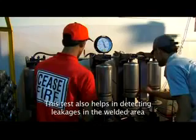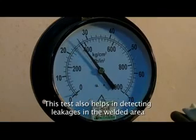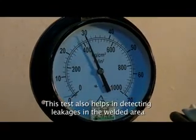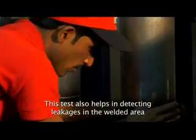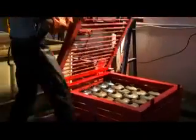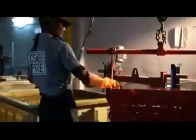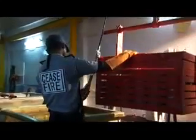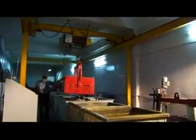Post welding, all containers are subjected to a hydrostatic pressure test at a minimum pressure of 30 kgf per cm² for at least two minutes. This test checks the pressure-withstanding capacity of containers. After the hydrostatic pressure test, acid and alkali-based chemicals are used to treat the outer body and insides of every container. This process cleans the container by removing oil and rust, and a coating of zinc phosphate creates the ideal surface for a more durable powder coat.